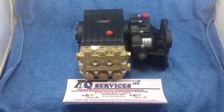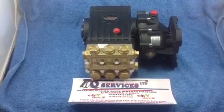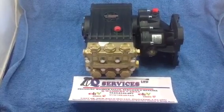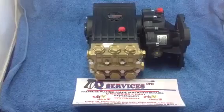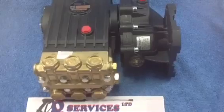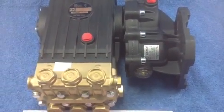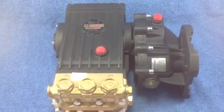Hello Qwashers at eBay and YouTube. What I've got here is the WS251 — 250 bar at 15 litres — with the reduction gearbox Interpump RS500. It has a 1 inch female shaft on the reduction gearbox, so the male engine shaft goes into it.